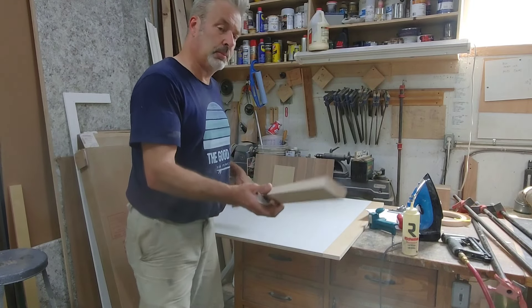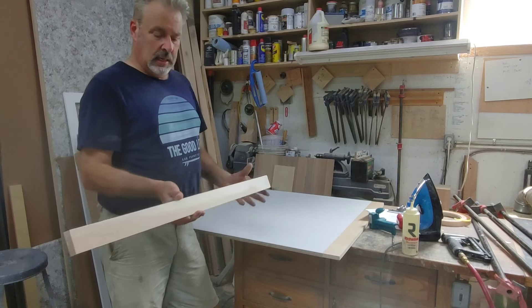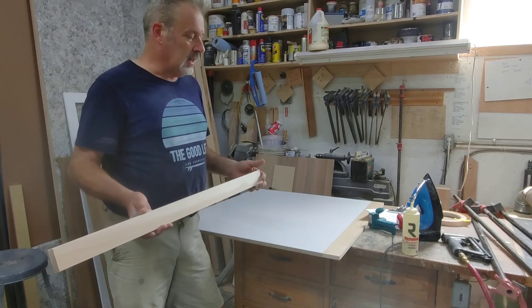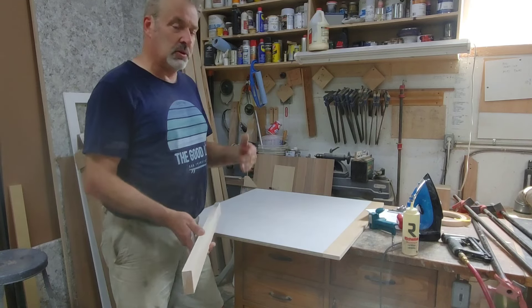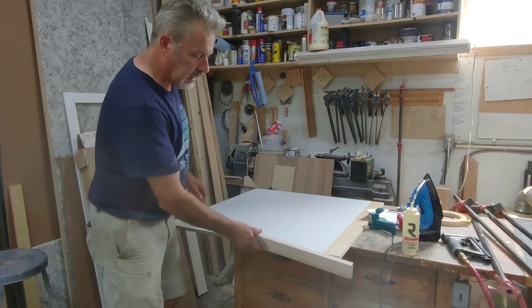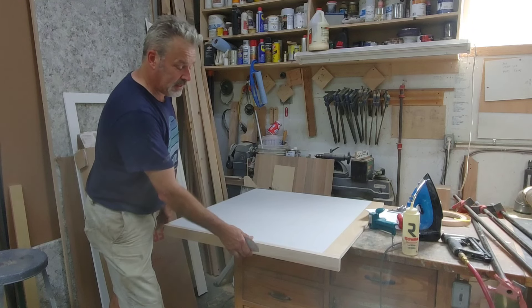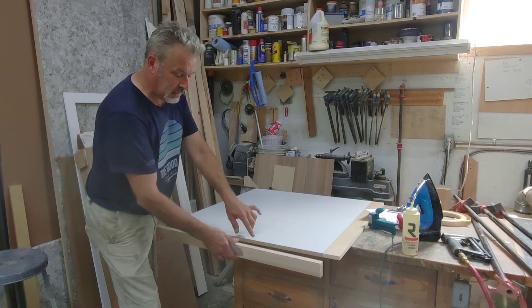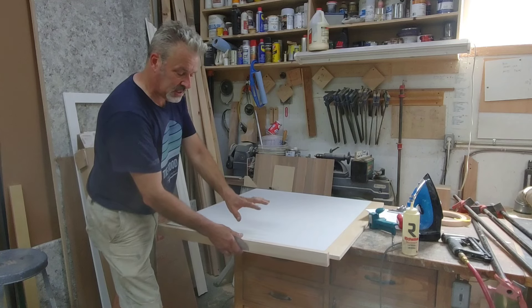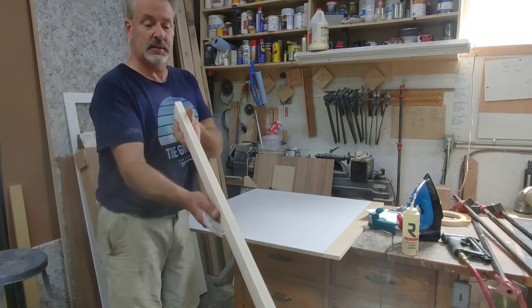I want to show you something here. I've got to put solid wood on this panel and when you're doing it you have a couple of options. You can miter it and get a nice tight edge, but I want a nice solid on here because it's going to be a post for an island. If I do it with a miter, my melamine edge is actually going to show, and I really don't want that because it can chip easily.